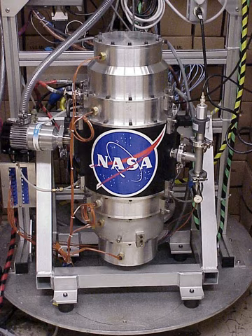Compared with other ways to store electricity, FES systems have long lifetimes lasting decades with little or no maintenance. Full cycle lifetimes quoted for flywheels range from in excess of 10^5 up to 10^7 cycles of use, high specific energy of 100 to 130 watt-hours per kilogram, or 360 to 500 kilojoules per kilogram, and large maximum power output. The energy efficiency ratio, also known as round-trip efficiency, can be as high as 90 percent. Typical capacities range from 3 kWh to 133 kWh. Rapid charging of a system occurs in less than 15 minutes.